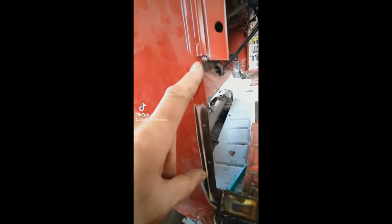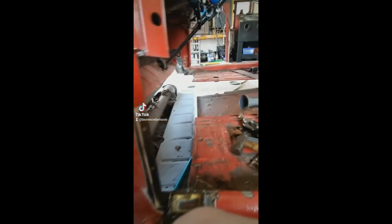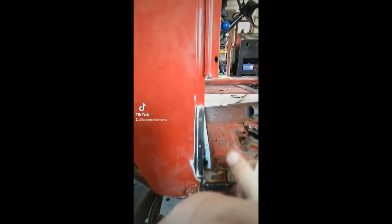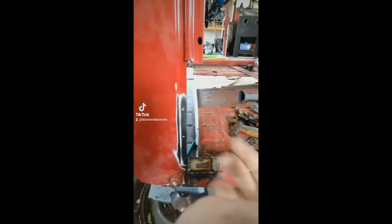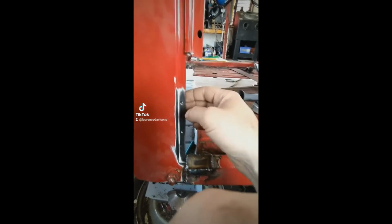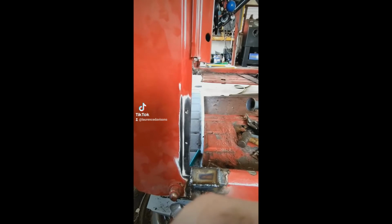That's that bit welded in, and now I'm going to clean this off, drill holes in it, and then plug, well, I'm going to cut this to length, strip it onto there and plug weld that into the Citroen. And then with this side, when I put this in, I'll drill through the other side and plug from the other side, so it's a sandwich and it'll all hold together nicely, because this wasn't at all. I literally pulled it off by hand.